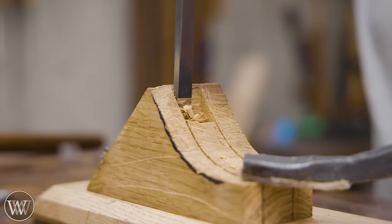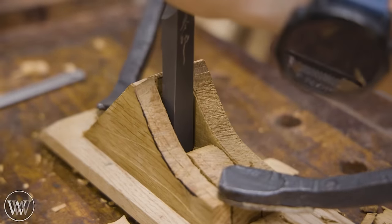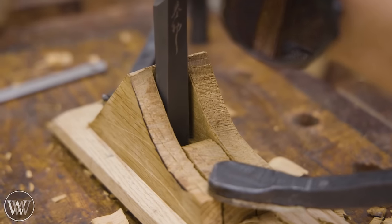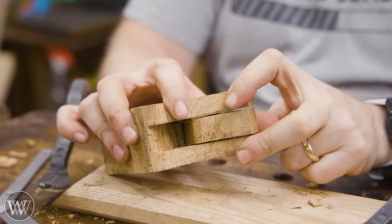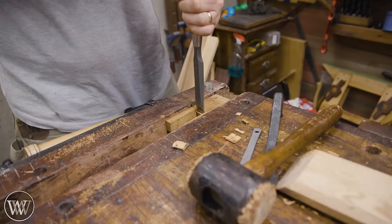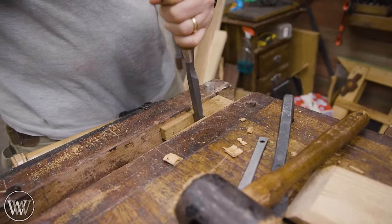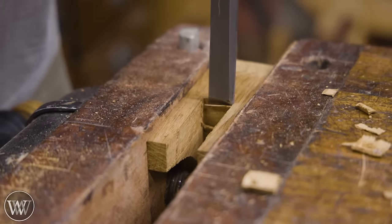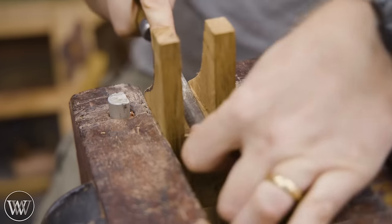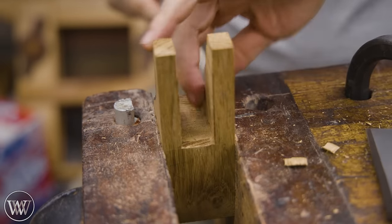For taking out the majority of material between those two cuts, we chop down and then pare out, chop down and pare out. Anytime you're doing large chopping, this is a lot of fun. I decided to go all the way through from one side but skew the chisel a little ways so the cut stays vertical but moves away from the line — that way I know it will come out the bottom a little farther away. Once I get close, we can break it off. To come at it from the other side, I put it in the vise so I can chop in the leg itself and play connect the dots from the top to the bottom.